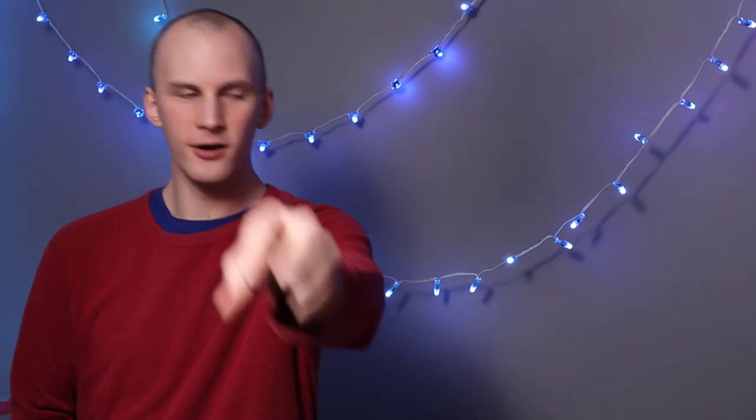Okay? Now, the next question that we run into is, okay, now that I've figured out where all my different ports are, okay, maybe I need like 14 ports over there, so I'm going to go with a 16-port controller. I don't need long-range ports there because I've got a mega tree or a bunch of stuff close together. I can power that all in that location. Once we worry about the physical, our next question is the data, okay?